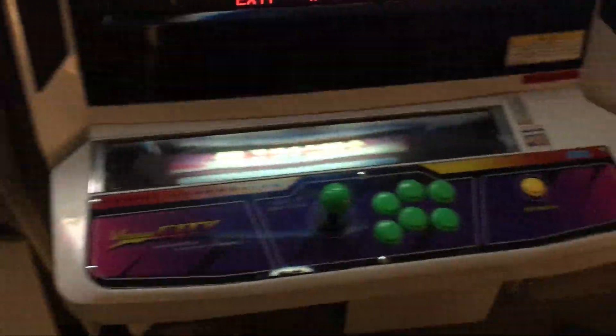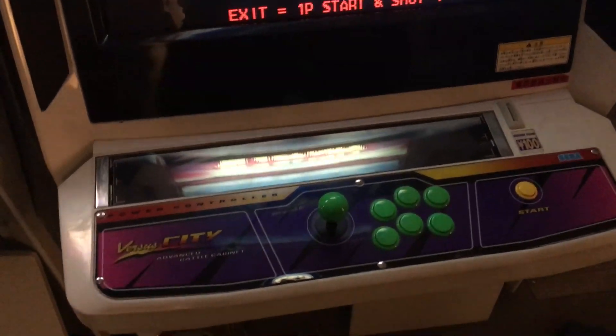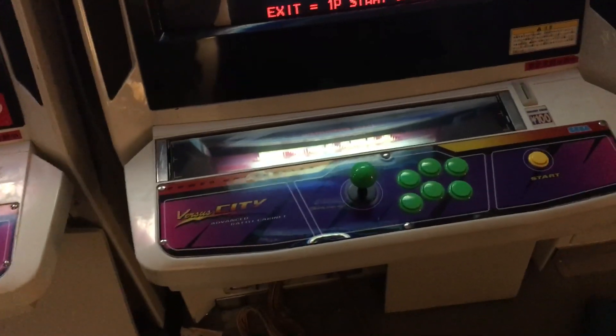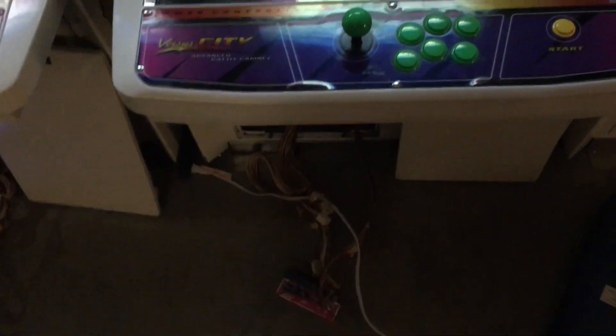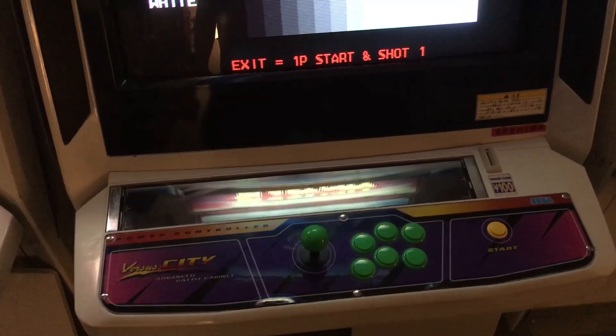The way this is set up is such that we have two cabinets. Both have single-player panels, and both cabinets are wired as single-player 1P cabinets. So between these two cabinets, the only thing separating them is which board is connected to which one — you'd just switch which player. So the cabinet wiring does not have to be changed to reflect that it's versus. If I take this connector out and put a game in, it's a 1P cabinet. There's no particular versus adjustment to the cabinet itself.